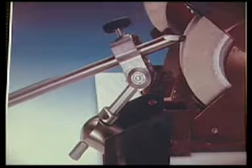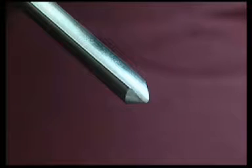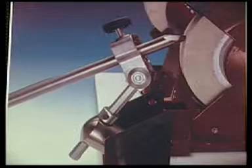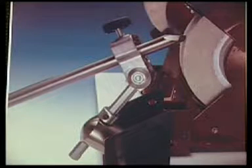When used in conjunction with a bench grinder, the Robert Sorby sharpening system, offered in 3 configurations, offers a comprehensive solution to obtain a consistent shape and finish. The first of these configurations is the fingernail profiler, which consists of a base and profiling arm. This is used to quickly and accurately form fingernail profiles, also known as Irish or Celtic grinds, on both spindle and bowl gouges. The locking clamp will hold all gouges from a 1/8 spindle gouge to a 3/4 inch bowl gouge.